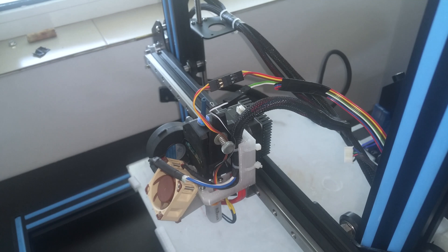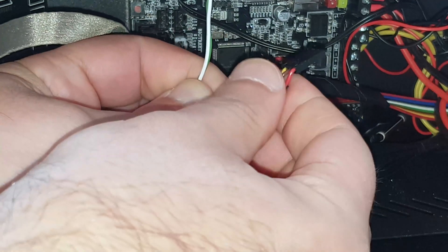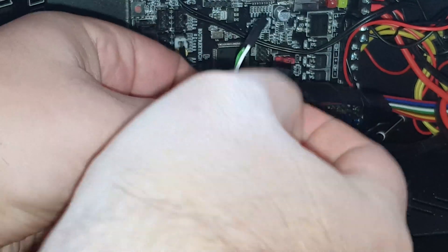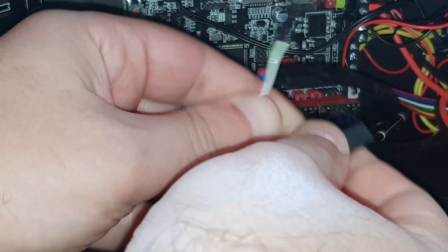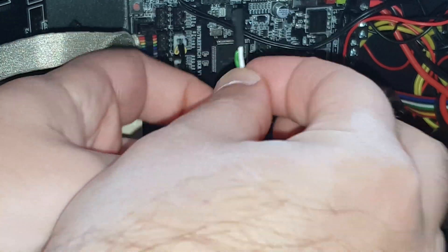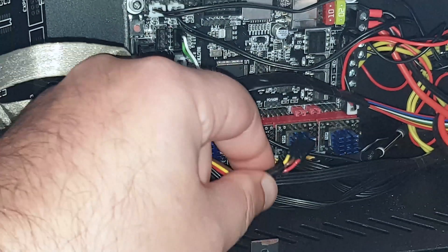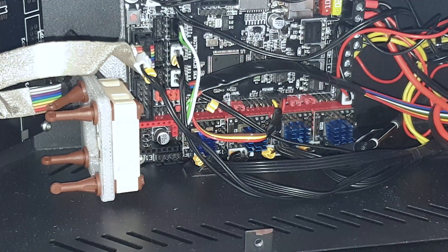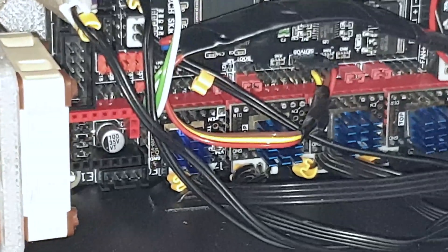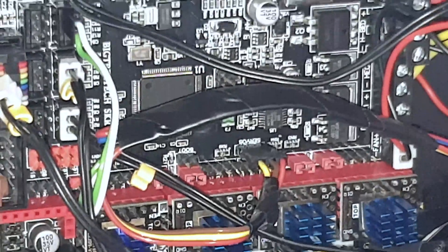Next I'll be connecting the probe to my control board. It is a 32-bit SKR version 1.3. The connection to the SKR is straightforward — no need for a pin 27 adapter like with the stock board. Connect the two wires to the Z minimum instead of the stock limit switch. The three-wire connector goes to the servo output. The only modification in the wiring is to switch the places of the brown and the red pins because of the layout of the servo connector.